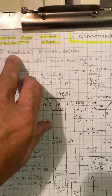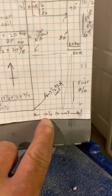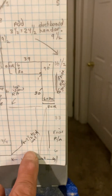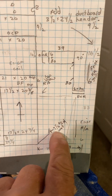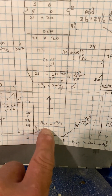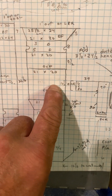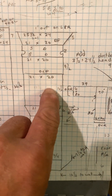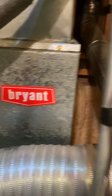Seems like everything's hard on it. The new furnace will sit 10 and a half inches to the two-by-six wall. The back of the furnace will be seven and a half inches to the wall wood. The furnace will sit on the base, then we have a six-inch transition, the existing coil — make sure the coil is clean — and a piece of duct canvas and a transition.